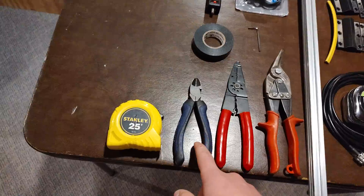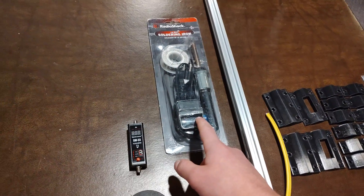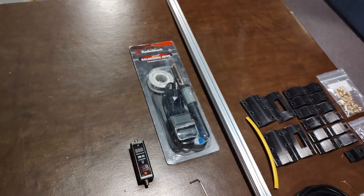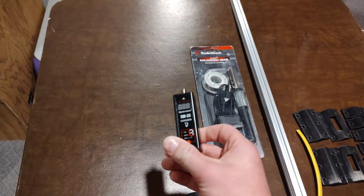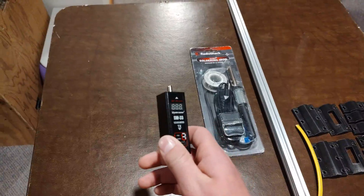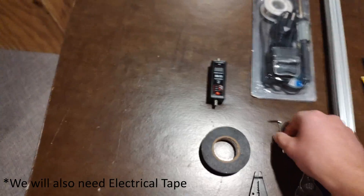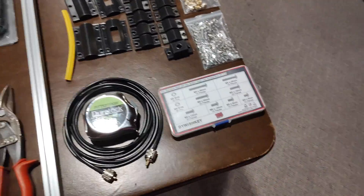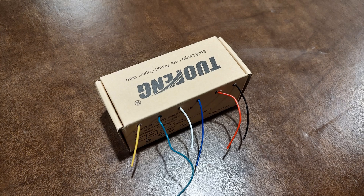Over on the tool side, we're going to need a tape measure, side cutters, wire stripper, and tin snips. We're also going to need a soldering iron for both pushing the heat set insert and for soldering onto the tape measures. Highly recommended — you're not actually going to need this, but it's an SWR meter. I highly recommend getting it, otherwise you could fry your ham radio. We also need a tool for our nuts and bolts. Just one more thing, we're going to need some 22 gauge wire for the hairpin match.